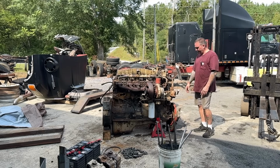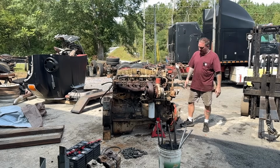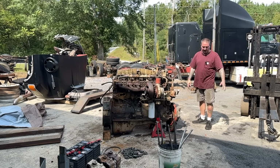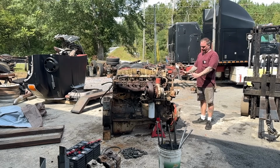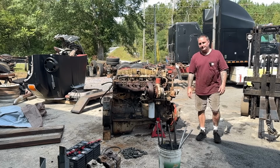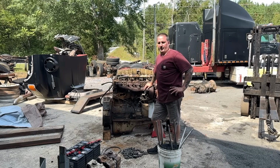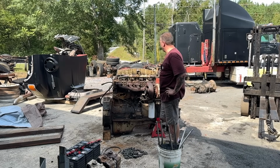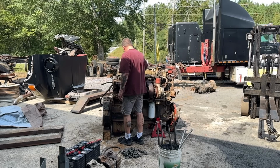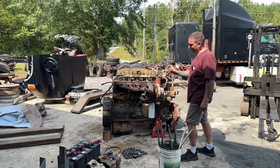We'll get this front cover off, get the camshaft out, slap a new cam in there, and then stick it all back together and see what happens. I'm gonna move this engine out of the way and clean up out here, and then we'll get this blocked up and apart today. We'll get it covered up for the night, but I'm just gonna have to get the cam out, put the cam from the other motor in it, and reset all the valves, and hope I didn't bend anything too important. And we'll get her back together, and bing bang boom, Bob's your uncle. This thing should run mint.